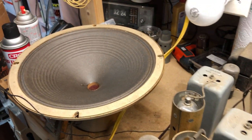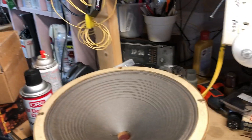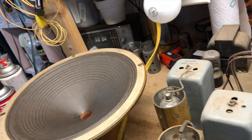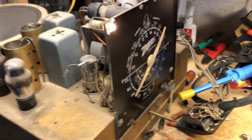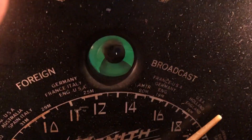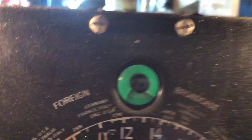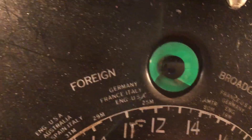Smoke test — the radio works. I can pick up one station on shortwave; I can't pick up anything on broadcast yet. It sounds like I'm getting something from Japan — shortwave fading in and out, kind of interesting. After so many years, the 8S-359 does speak. If you look at the eye tube you can barely see it glowing — I'm going to turn off some lights so you can see it better. I'm surprised it actually has that much glow to it. There are some issues with the tuning and the AVC because it's not closing like it should.